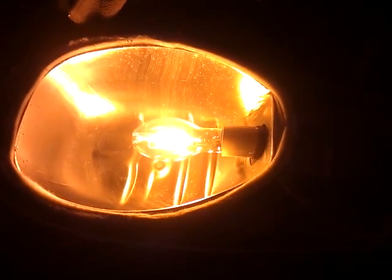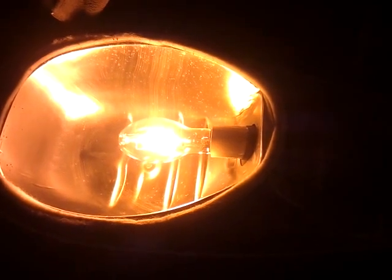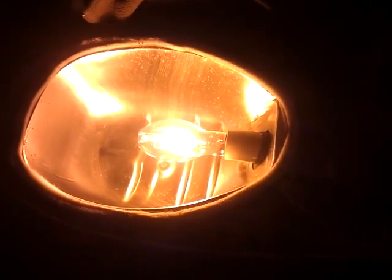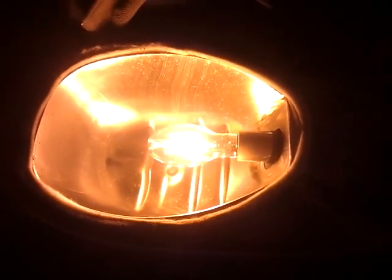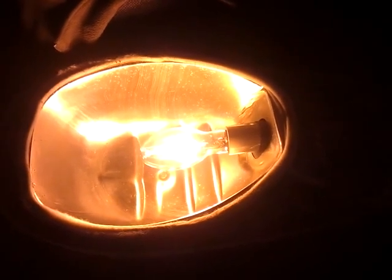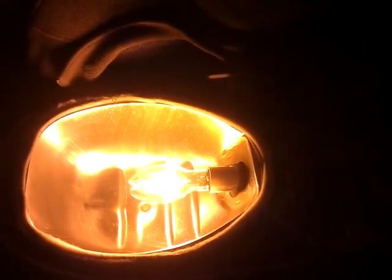What I'm working on now is getting a new photocell to see if that switch still works. I'll wire it back up the way it was, and I'll get the proper bulb for it. Because I know it's not a good thing to have a lower powered bulb for the ballast, because it'll blow out the bulb eventually from what is it called, overriding the bulb or overdriving it.